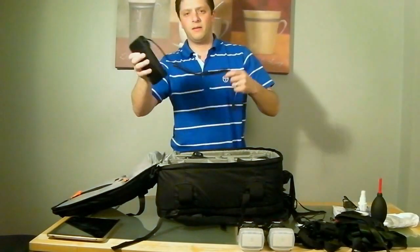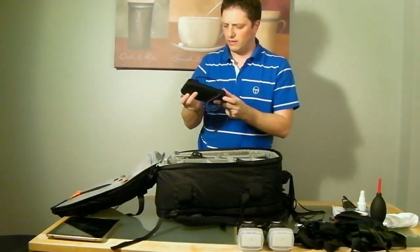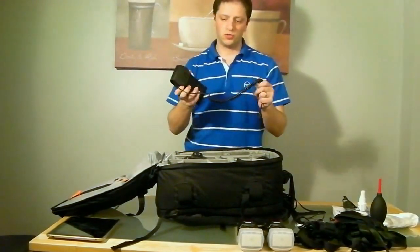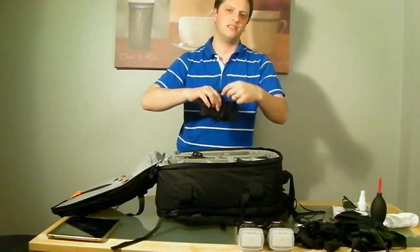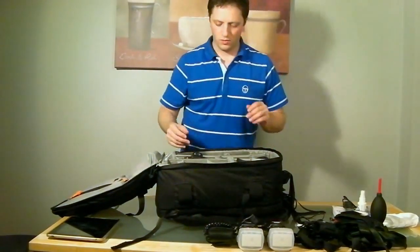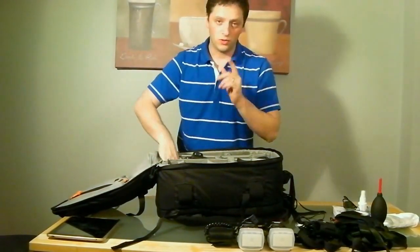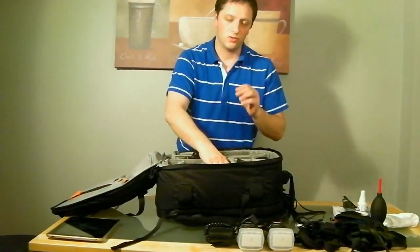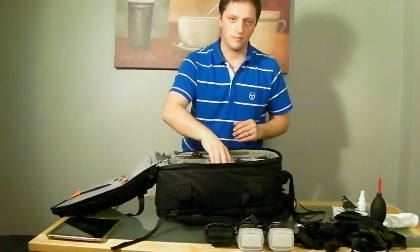I have the Pixel TD-382 battery pack, which is a battery charger for one of the SB-900s. I've only got one at the moment — haven't had the need for two. It recycles the flashes much quicker, though it won't solve the SB-900's overheating problem — it'll actually make it worse. But if you need that speed for a short period of time, it's perfect.